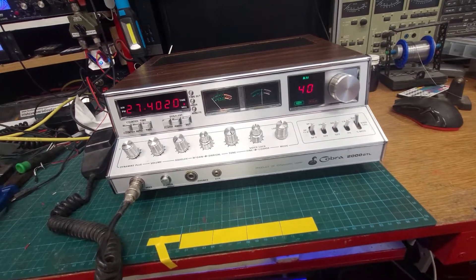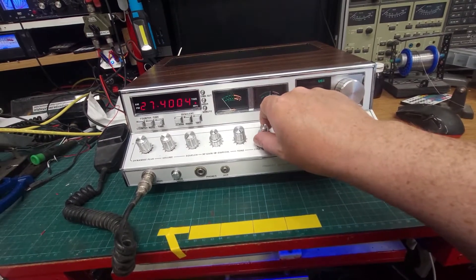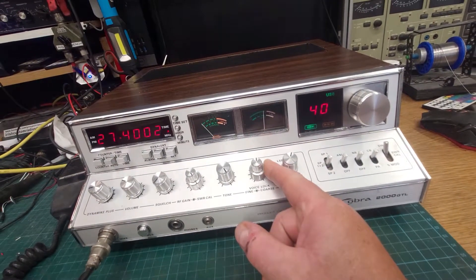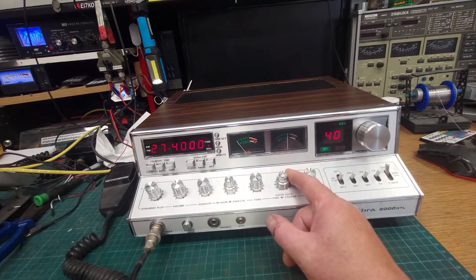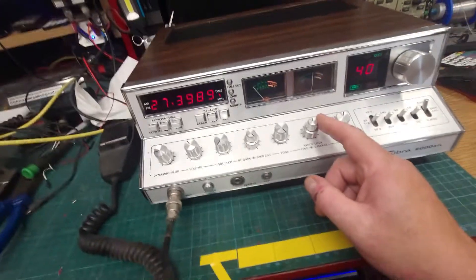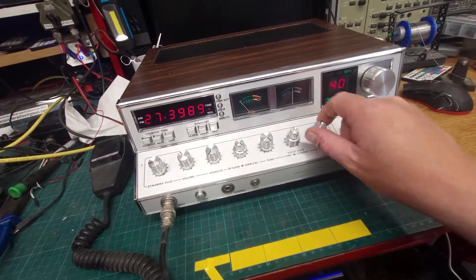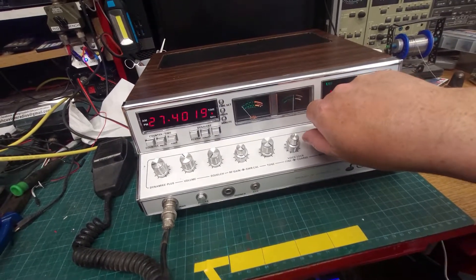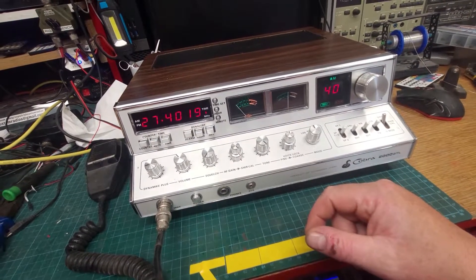Counter module is okay. She's a mile off tune. That should be 405. So she's in the notch there — it's like 6kcs off. That's an upper, not too bad there, it's 3kcs off. The only place it's right is lower sideband.